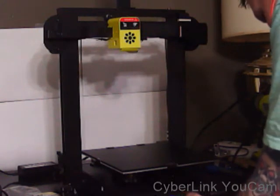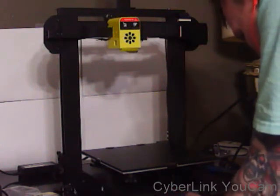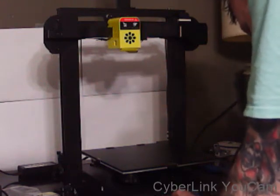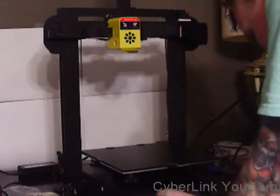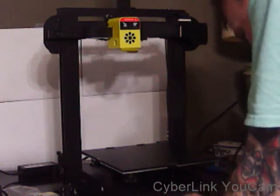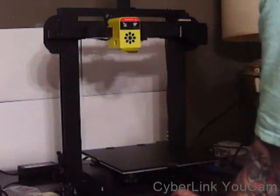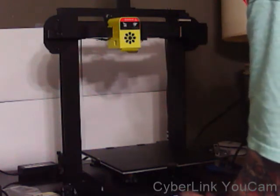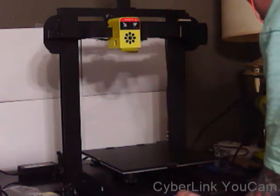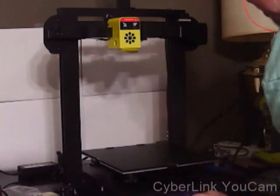So we'll go back here, level settings. Enable auto leveling, no. If you had a BL Touch, it says enable BL Touch, yes. I need to turn that off because there is no BL Touch installed in this. Probe connector, Z Max, probe Z axis. Basically, a BL Touch is an auto leveling sensor that you can purchase separately. Manual leveling coordinate settings basically tell you what points of the bed the nozzle will go to in order to level your machine. There's an option on here that will automatically move the hot end for you to level your bed.